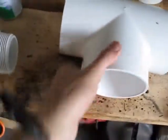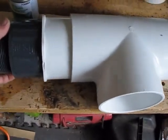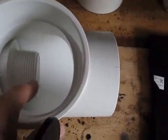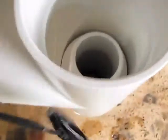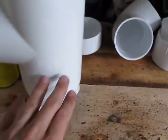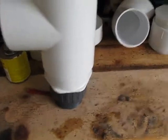The next step is to insert this into the actual PVC-T and glue it in. I'm not going to push it in yet, but it will end up a little more than halfway down. After that, I'll flip it up — you'll see the gaps along the edges inside — and I'm going to pour some marine epoxy down there so this entire valve is completely solid material, which will provide a lot more strength.